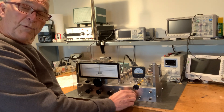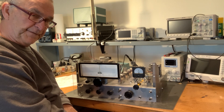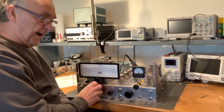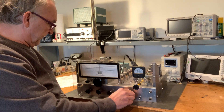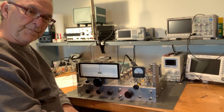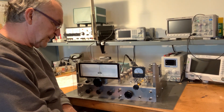One of the features of the HBR designs — all of them — is that they have regenerative amplifiers. The mixer amplifier is regenerative, so you can easily crank the gain up until the whole thing overloads. It's really about learning how to fine-tune the various gain stages. From what I've read, the technique learned since the 60s is to not provide a lot of gain ahead of the mixer, but to put the gain in the IF stages. Today I have the RF gain cranked all the way up, and we're moderating the mixer gain and IF gain.